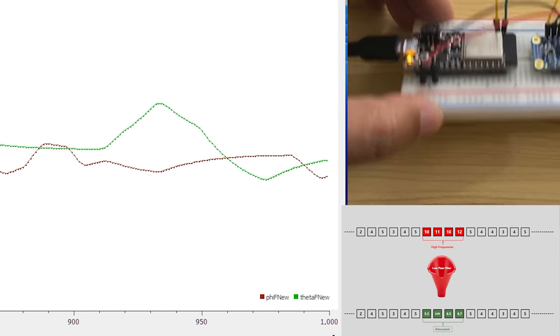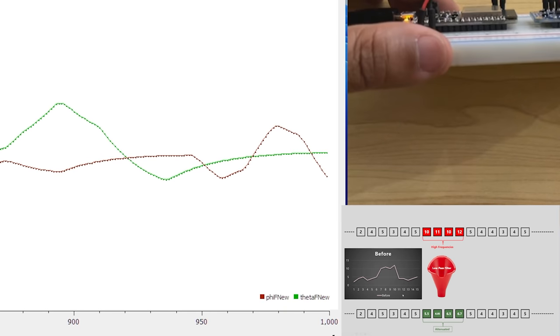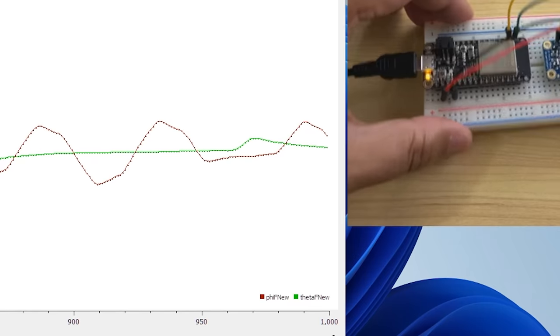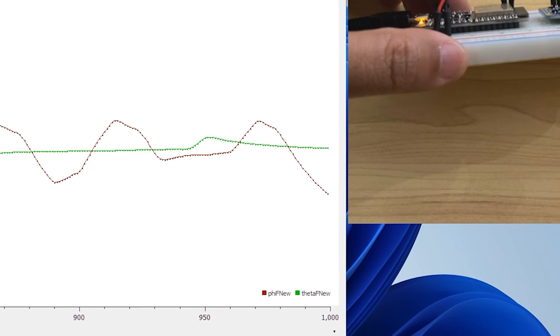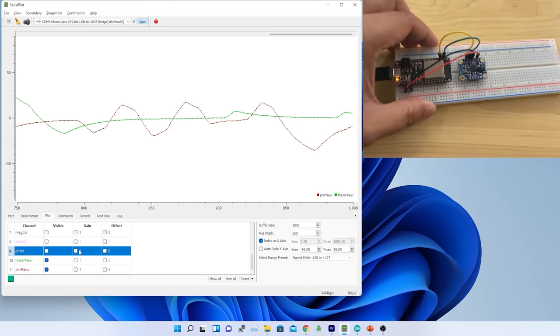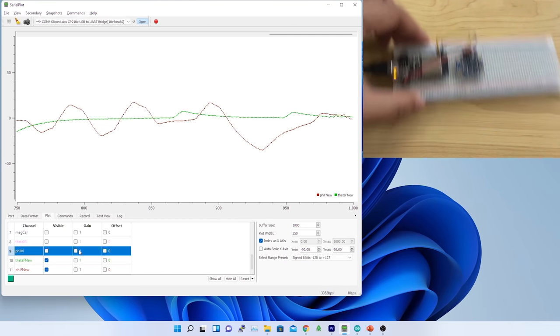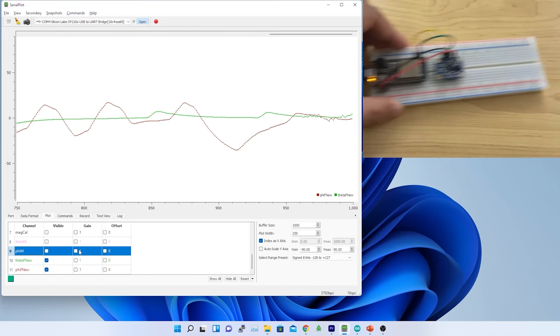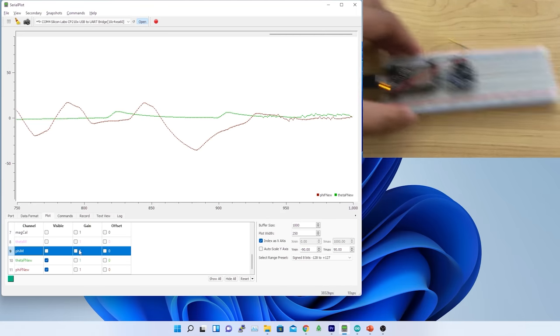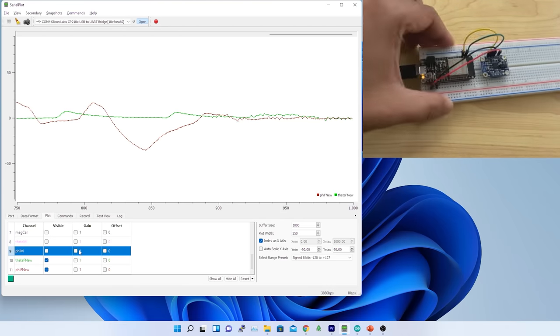During this journey of development, I thought I would get ready-made data out of BNO055. Unfortunately, I had to choose the hardest path to implement sensor orientation measurement from scratch. So far I have learned what an accelerometer is and how it works, how to measure approximate tilt based on raw accelerometer data, and how a low-pass filter can be used to denoise unwanted signals produced by the accelerometer.